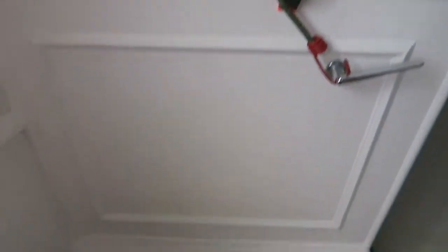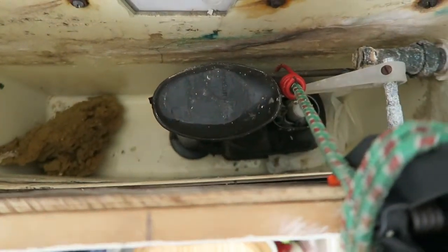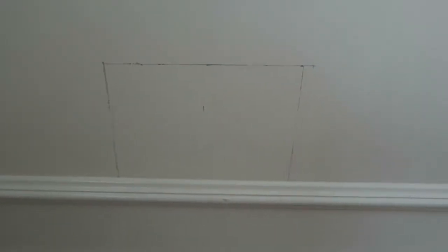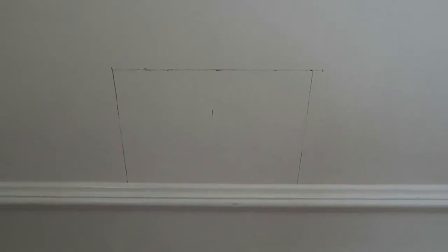Well, this cistern ain't gonna be easy. Years ago when I redid the bathroom, I boxed the cistern in, not thinking about if I need to maintain it. So now the siphon's gone and I can't get at the nut at the bottom of the cistern. It's all boxed in — I've got to get the siphon out, so what I've got to do now is cut a hole in the bottom so I can get to the nut. I'm a bit of a nut for leaving it like that, aren't I.